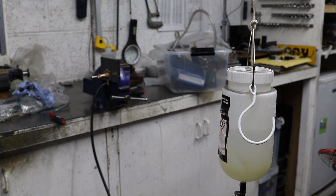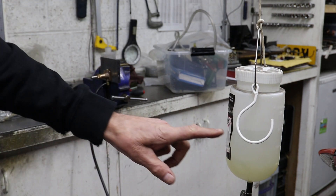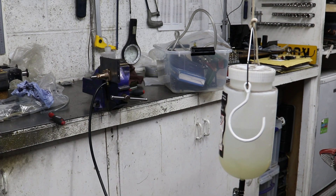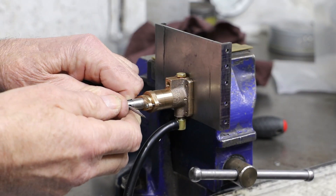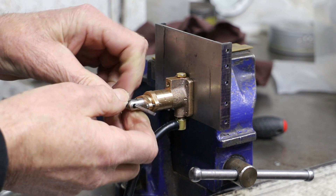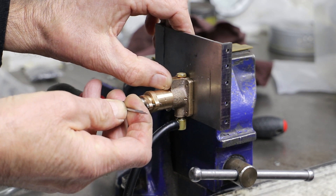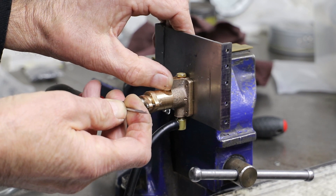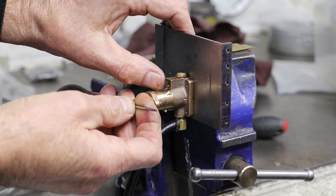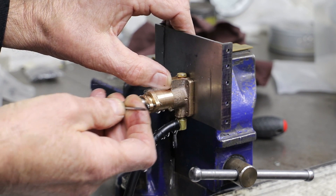Let's give it a test. I've got some water in the bottle here which is connected via this hose into the pump inlet. In this position the water level is about 50mm above the pump, so enough to give a positive pressure at the inlet. I've not got the outlet union in place here, but you can see that as I push and pull the ram, water does flow at the outlet, and if I try and seal it with my finger the water does get forced out. Unfortunately I don't have a pressure gauge so I can't check what pressure I'm generating and whether or not it's enough to get into the boiler. But as it's a positive displacement pump, my tolerances aside, that should not be an issue. On this cheerful note I'll end this video and say thanks for watching.